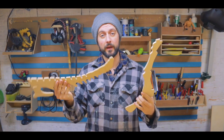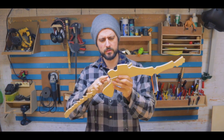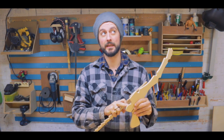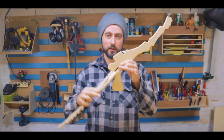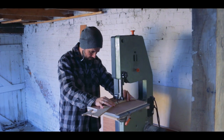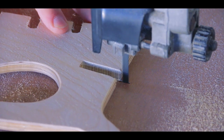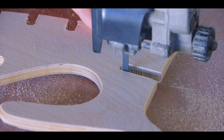Now I'm back in my workshop with the dino parts to do one final thing. The plate was not exactly 9mm — it was about 9.2 or 9.3mm — so the dividing pieces we cut just don't fit; they need a little more space. I'm going to bandsaw a little bit, sand a little bit, and hopefully have a huge dinosaur to put together.